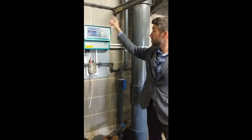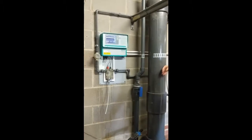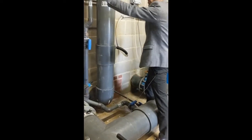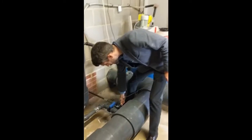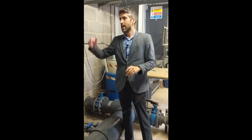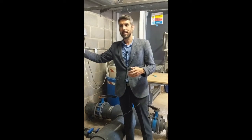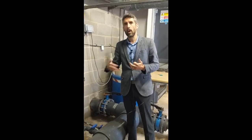What's happening is the water comes through and then it loops back — it goes through the monitoring equipment and re-injects back into the suction side of the system. But you can isolate the chemical dosing here and here. When we do a backwash, we're going to be re-establishing flow again. There's usually a time delay of a couple of minutes before it sparks back up, but you don't want chemical dosing to start back up during the backwash. This isolation will ensure that even when the backwash is running, it still won't be able to detect flow going through the system.